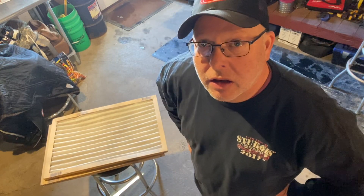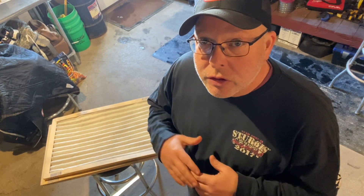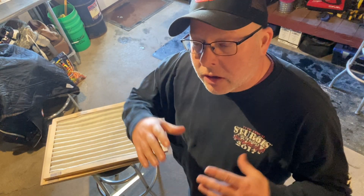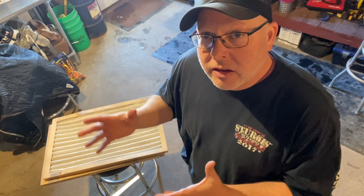Here's a little tip for furnace filters in the winter. If you notice that your heater or furnace is short cycling — meaning it doesn't get up to the temperature it's supposed to, it shuts down and then resets and starts again — usually that means it's not getting enough air. In the summer it's generally worse where I live because we're on a dusty road with wind blowing.